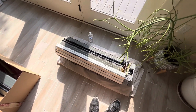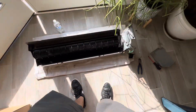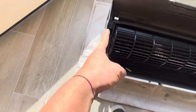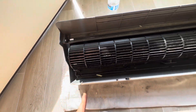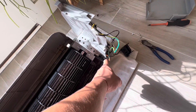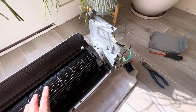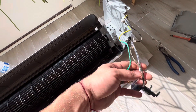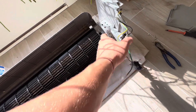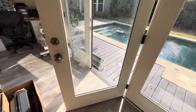What you pretty much need is a Phillips screwdriver because everything on here is Phillips. Out with the old, set the new one in. There are two screws here — one there and one down here. Then you take this one out. I took the cover from the board because I thought I had to remove the board, but no — you just take those two screws on that side, one on that side, disconnect the ground, take this temperature sensor out, this other sensor out. Get everything out of the way and then you just lift the coil straight up and get it outside.